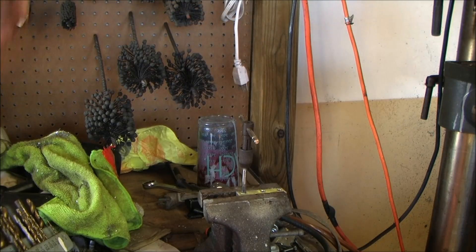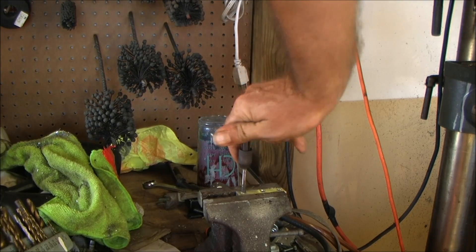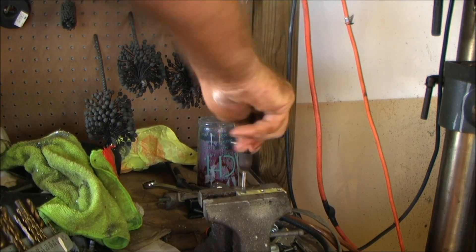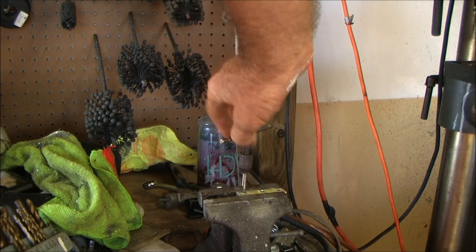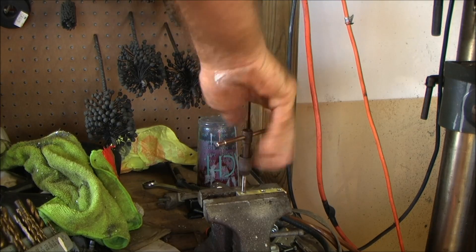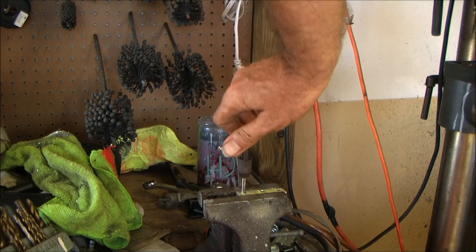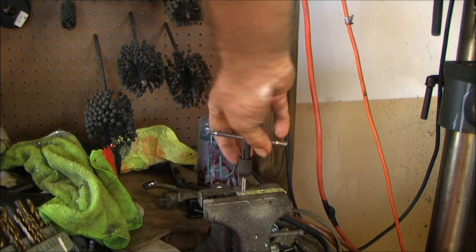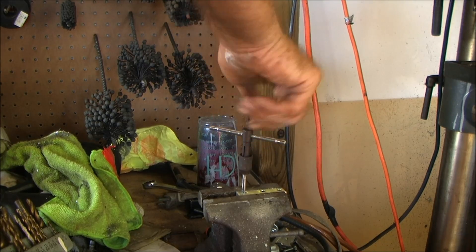Now I'm already through enough that I don't have to back off and clean it anymore. In case you're wondering, the aluminum grade — the package says 6063 but I ordered 6061. Normally I'd expect to see a 'T' on that number and I don't see it. Run your tap all the way through, then stop and back up — don't let it go all the way through without leaving one or two threads caught so you can bring it back.